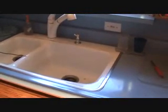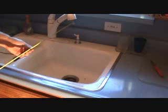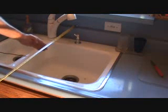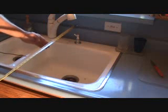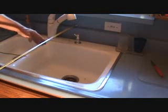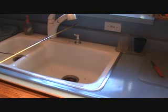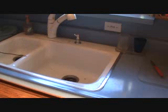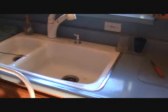So if you want to measure the whole wall, from there I got 24, but actually the wall there is 25 and a half. Okay, so even at that point, if I want to get a little bit out away from the center, I can go about 14 inches or so. That's the sheetrock wall there. Okay, so 14 inches. How's that sound, Uncle Eddie? It sounds right, 14 inches or so. I think that'll be fine. You just don't want to get the light too far back this way, because then you're going to throw a slight shadow. Not a whole lot. I mean, we go 14 inches. That should be fine.